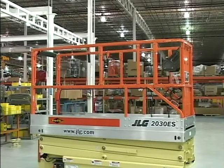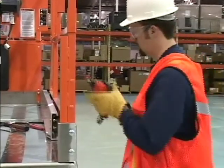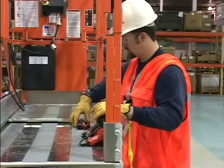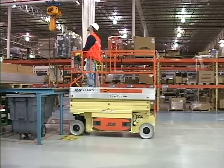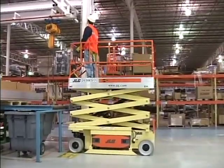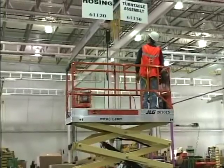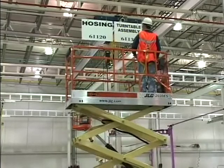Do not carry materials directly on the platform railing unless approved by JLG. Always ensure that power tools are properly stowed and never left hanging by their cord from the platform work area. Never attempt to use the machine as a crane. Do not tie off the machine to any adjacent structure. Never attach a wire, cable, or any similar item to the platform. Do not allow personnel to tamper with or operate the machine from the ground with personnel in the platform, except in an emergency.